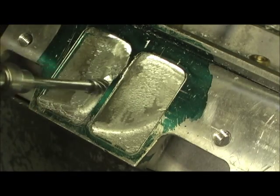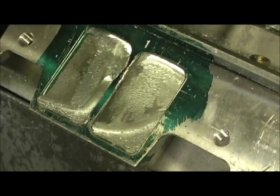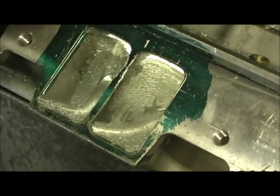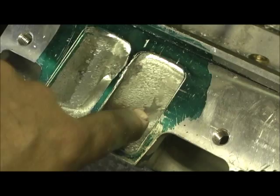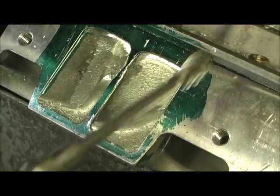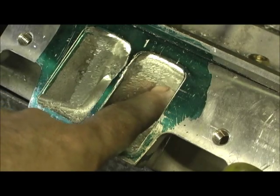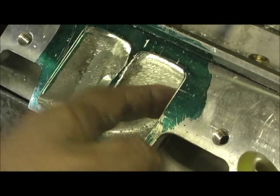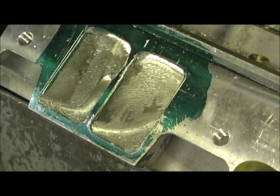I'm going to start pulling that back, trying to get the best window I can get. Now, in order for consistency to really come to play here, you have to leave one wall untouched. The wall that I'm leaving untouched is this wall right here. You can see where I lightly grazed over it some, but it's basically untouched, so that side has got an instant center for me to be able to measure off of — to know how far to move that wall.